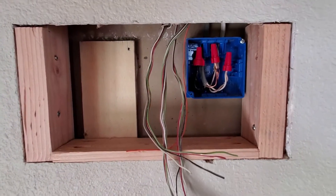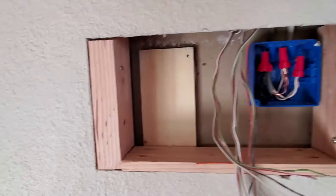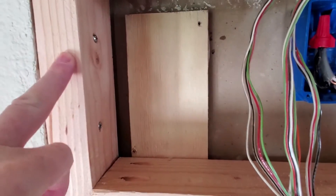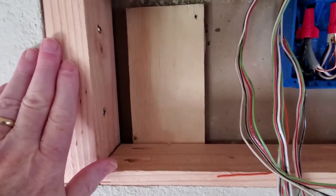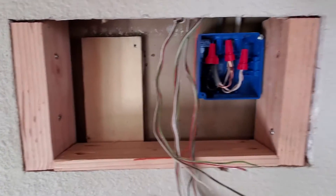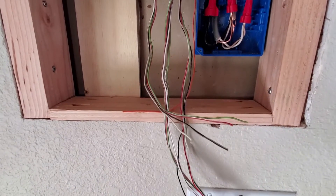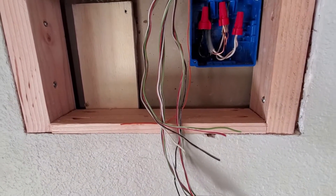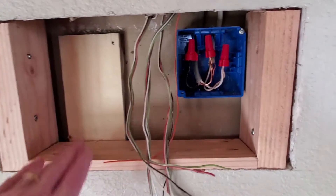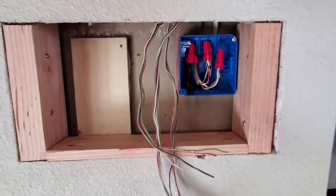What I've done here is installed a couple of 2x4 sections that screw directly into the original wall studs behind the finished sheetrock. You have to cut and mount them so that the 2x4 is exactly flush with the front of the drywall — that's going to carry the new wall mount plate. I also put a small spacer piece on the bottom, but you can screw directly to the 2x4s and it will be supported just as well.